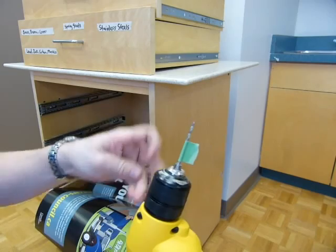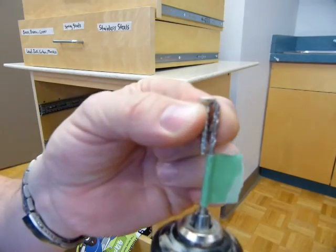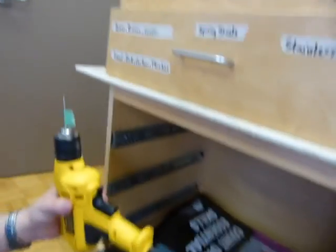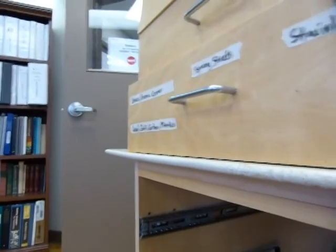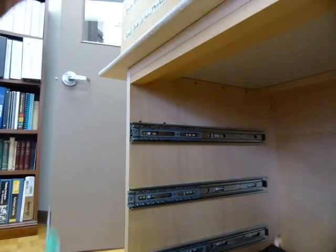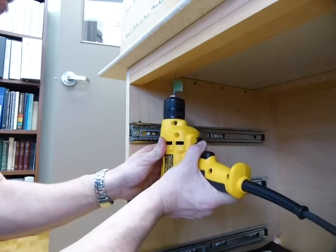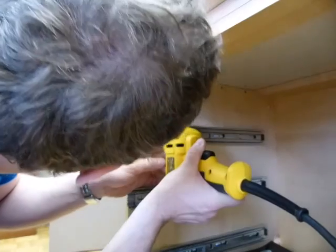You can see how the screw length meticulously matches the placement of the green masking tape. See? So I don't drill it in too deep. And what needs to be done now is I'll just come on down a little closer. Almost there. There we have it, and there. Put my drop sheet underneath to catch the shavings. Every so often clean the chips from the drill bit.